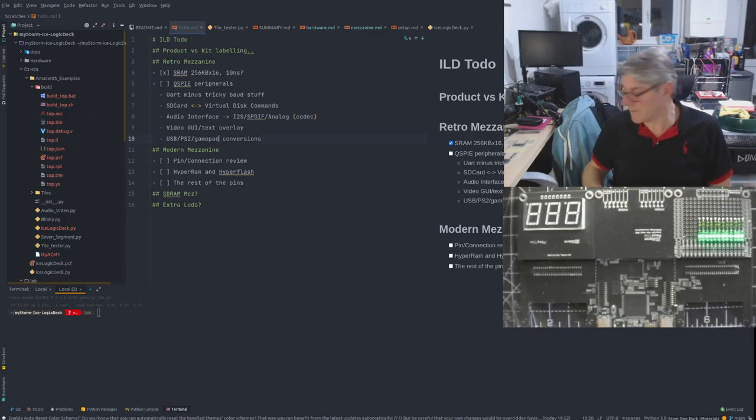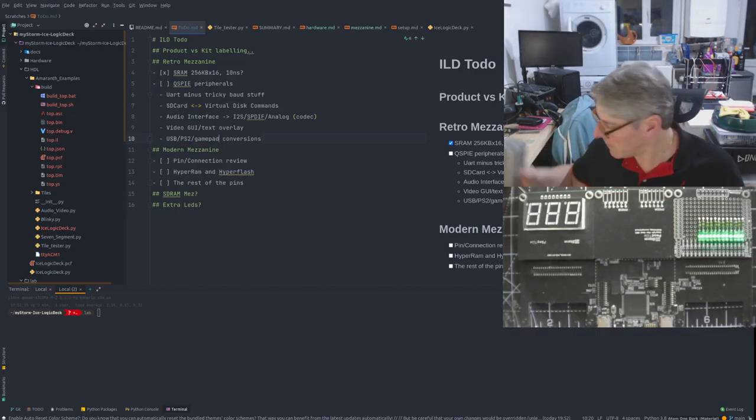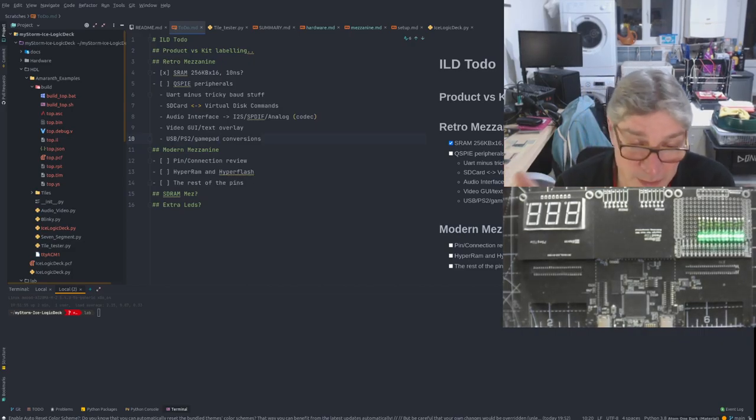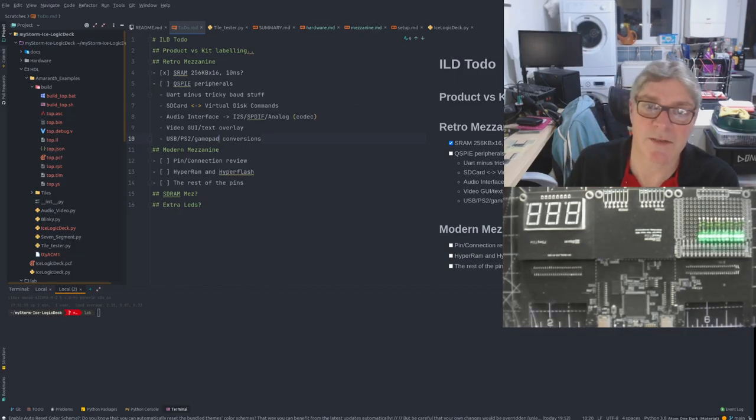Clearly, it looks from the links that you've been sending on Discord that there are a number of ways that MiSTer solves the problem, both on the von Neumann side and on the FPGA side. I think we need to look at that more deeply and work out which way we're going to go, because it's not obvious. So that's still a potential for QSPI, certainly from a USB point of view, but would there be any point in PS2 type stuff on the STM side, or would you always want to do that on a tile, even if the tile had, you know, expansions?